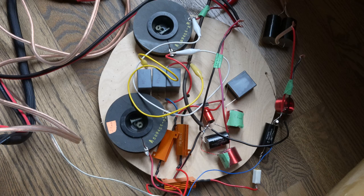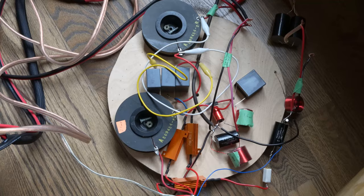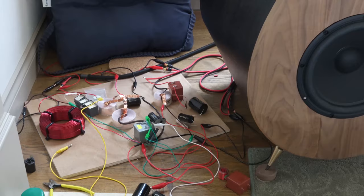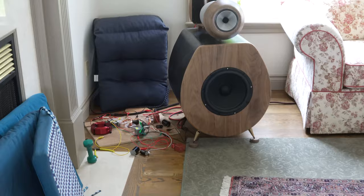The active experiment was great to decide where each driver should start — like the cutoff frequencies. Looking at the specs of the speakers also helps determine the crossover cutoffs. I started experimenting with cheap components to get an idea of which parts I needed to order, because you don't buy expensive capacitors and then realize they need to be a different value. You can't just rely on computer-based generic simulations — those are a great starting point but reality can be quite different. There was a lot of experimenting with parts, sweeps, measuring, and listening — a journey that took two to three months just to decide which parts to order.